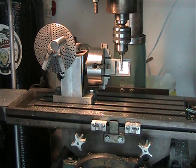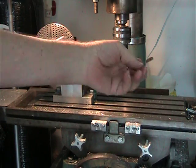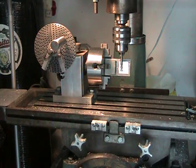The process I'm using here is to use my dividing head to be able to rotate this as I'm milling back and forth cutting it out. What I'll wind up with is a semi-circular hollow underneath here that you'll be able to see as I go along.